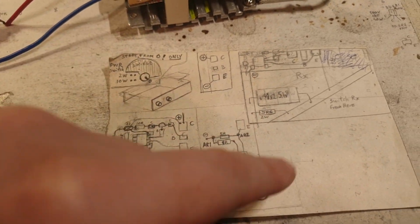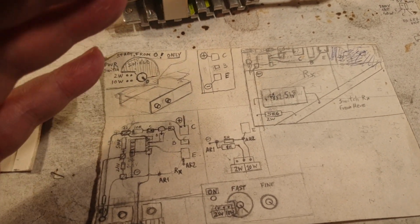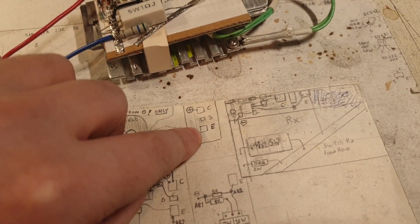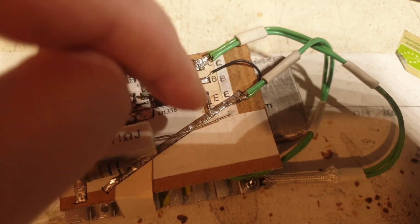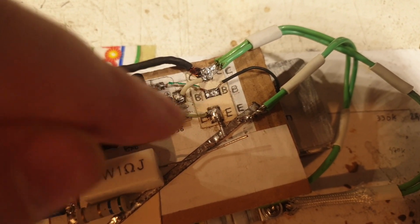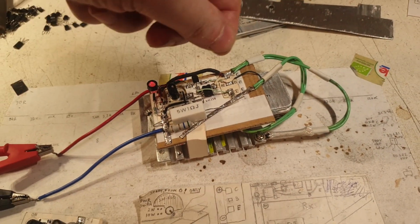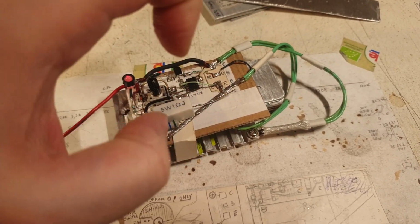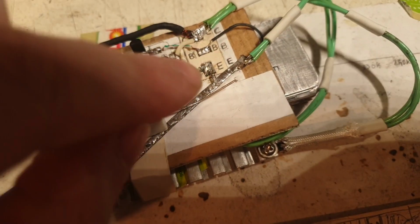But while I was thinking about this circuit and how to make it better than it was before, I got over a couple of issues that the other board before this one was having, like the naming here, collector, base, and emitter, which I already changed here, and I put larger pads there and there, especially for collector and emitter. For the base it doesn't matter, but initially they had this pad size for the emitter and the collector, and they were starting to get out from the cardboard because they are very thick wires, as you can see, and they were dragging a lot. I was moving them a lot, and the pad in the cardboard was ripping out, pulling out the cardboard, and the cardboard couldn't hold it securely anymore. So I made a larger surface, a little bit larger than it was before, and I suppose now it's better.